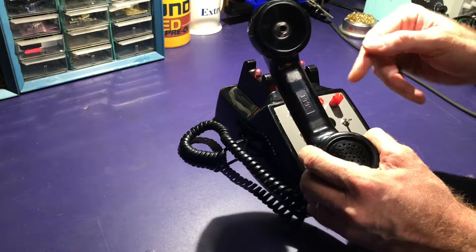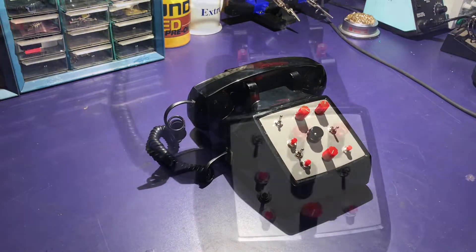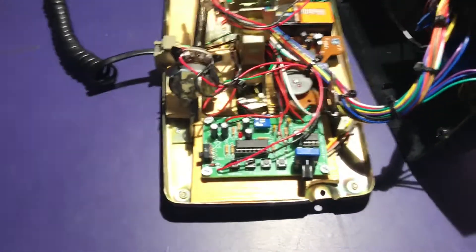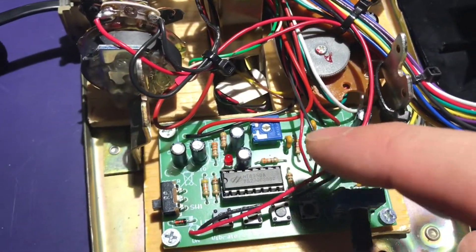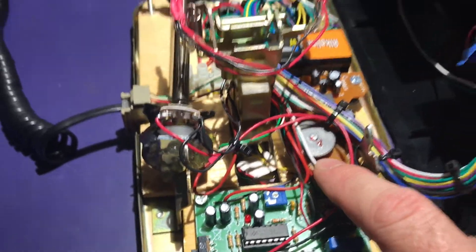So you can plug an instrument, or another mic, or audio equipment, or pedals, or whatever you want into there. On the inside, we have the microphone comes in. It goes directly to the voice changer. And then from the voice changer, the output of the voice changer goes to the bypass switch.